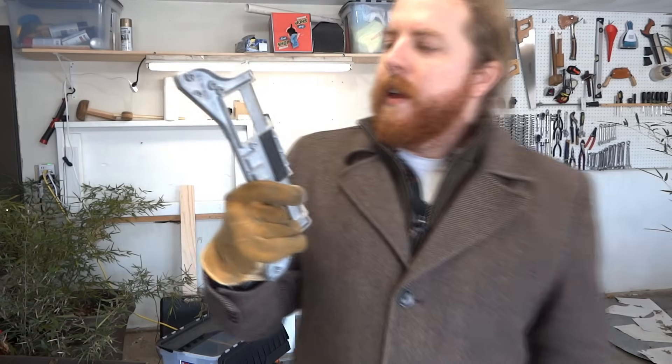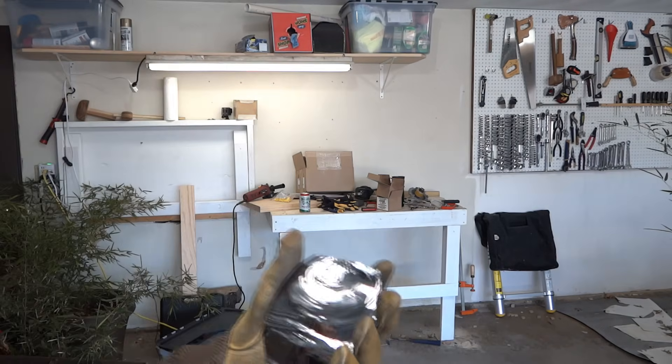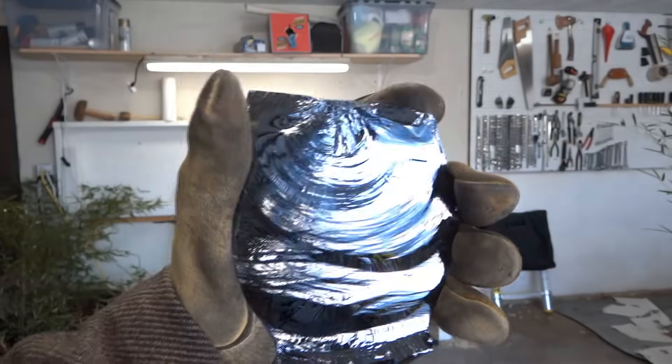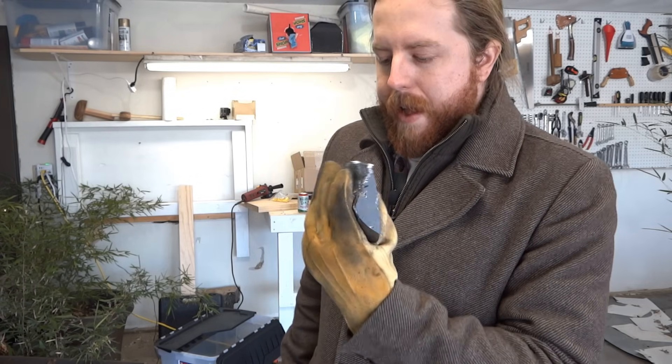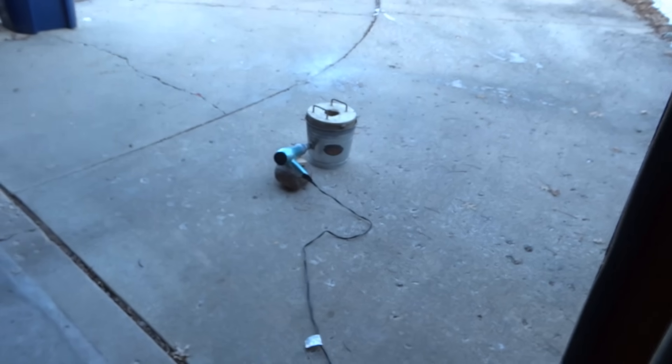Cast aluminum is not pure — it's got some silicon in it. And I don't mean silicone, like the caulk around your windows. And I don't mean silica, silicon dioxide, which is like glass and quartz and granite and flint. I mean silicon — elemental silicon. I got a piece of it here. It's kind of glassy but it also looks like chrome — chrome glass. Pure metallic elemental silicon, that's what it needs. I'm not going to put this in because it was sent to me by a guy whose name I didn't ask if I could say on the internet — but he's a nice guy. I'll use this later to alloy up some bronzes. Moral of the story: the metal is not going to have silicon in it, so it's not great. But we'll worry about that later. Let the heat begin!